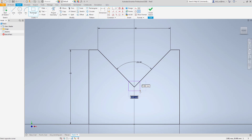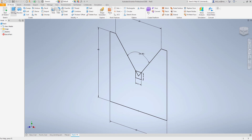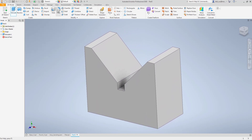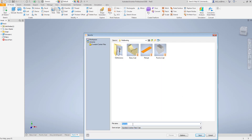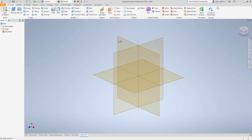I'll add a small rectangle at the bottom of the V to ensure that any radius from the bending result is compensated by this rectangular groove — making it a little bit deeper. Then I extrude using the mid-plane option with a width of 25mm. I'll add a 2mm fillet to make sure the plate doesn't get scratched during the bending process. I'll save this as the die file.